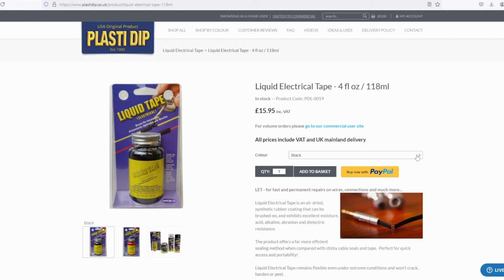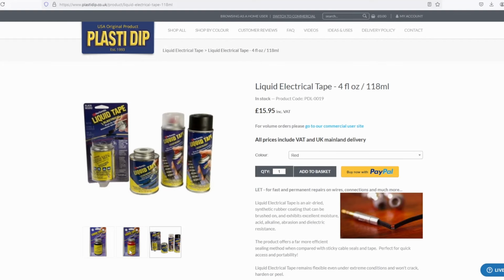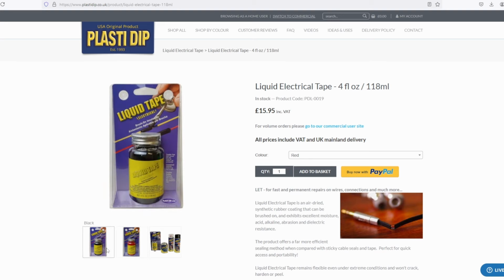Because on this center post, you need to use the coax, which we've talked about. And the big thing is you need to seal that coax. Now, I've used something called liquid electrical tape, and it's absolutely awesome stuff. I used 3 coats on this in the coax to stop any water ingress, so it's unlikely that's ever going to happen. But nevertheless, with this new method that I'm going to show you, and I've never seen anyone do it just quite like this.